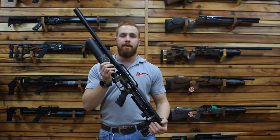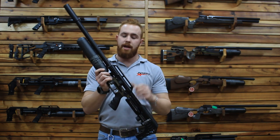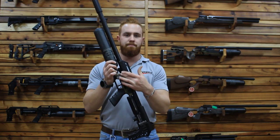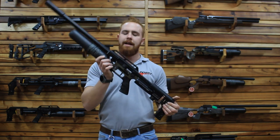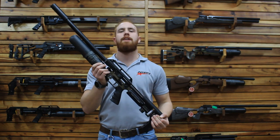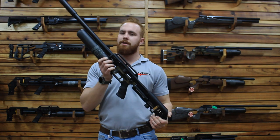If you're looking to upgrade from there — going for what we call a slug ready gun — you will then install a superior heavy liner on the inside and a slug power kit. That power kit consists of a pin probe, not the pellet probe, a soft return valve spring which is a softer spring that goes in the front and controls your valve — how quickly it opens and how long it stays open — and then a tungsten hammer, which is now the latest thing. It used to come with washers, but the new kits come with a tungsten hammer. They are 1.7 times denser than steel, so they are effectively heavier and open your valves a lot easier.